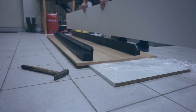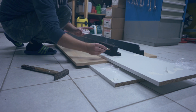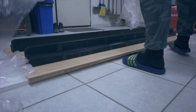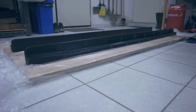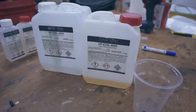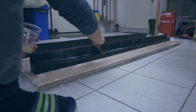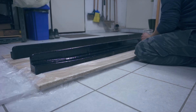Up next was smoothing out the surface of the assembled extensions. I started off by gluing the extensions down to an MDF board, using an extra board to have them glued perfectly straight so when I start adding material and it hardens, the extensions don't end up crooked. I laid down a plastic film and mixed up some epoxy. The epoxy I'm using for the entire project is a regular all-purpose laminating epoxy. I gave both extensions a nice coat so every nook and cranny was closed up, then followed it up with some glass fiber body filler — it sticks to the epoxy much better than the PETG itself.